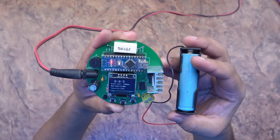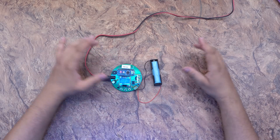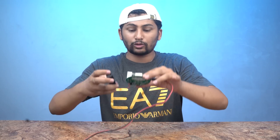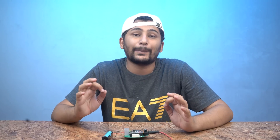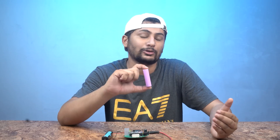It will take a little time and then it will show the result. We wait for about 10 minutes — sorry — and now let's check the capacity. It is reading 113 mAh after 7 minutes. So you can measure lithium battery, lithium cell, and lithium iron phosphate cell capacity. Because when we use an old cell, we don't know how much capacity it has — whether it is 2000 mAh, 1500 mAh, or 10,000 mAh.